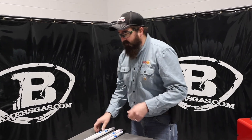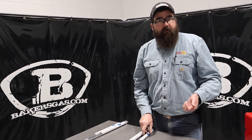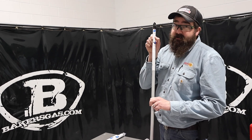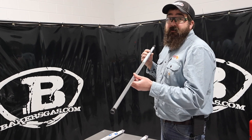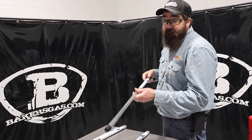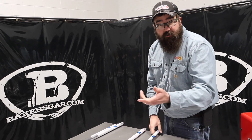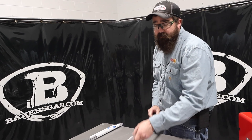On filler material, one thing I always recommend — people always have situations like needing to weld an aluminum trailer fender or something. We do have one-pound packs. This is 4043, and again, 3/32" diameter — great all-around size. You might want to jump up to a bigger size depending on what you're welding, but this is very versatile. You can weld on trailer fenders. It'll run on the majority of aluminum products except for structural aluminum, where you'll need to go to 5356. But this is just a good all-around filler — it'll get you to where you need to be.